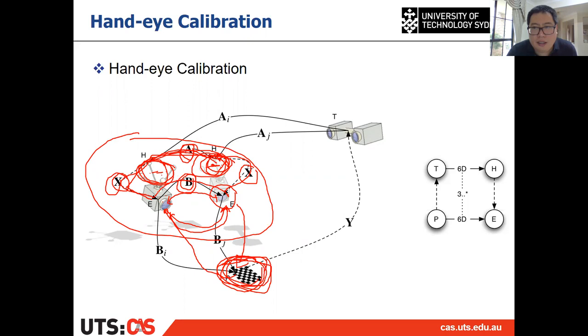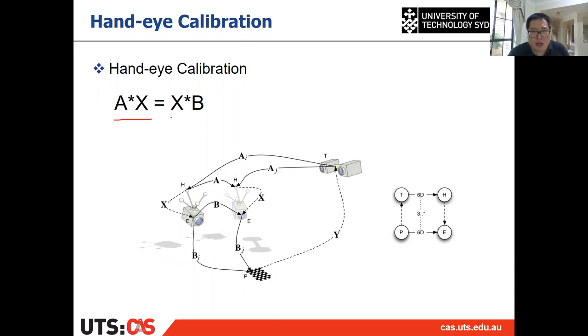So if we want to calculate the relative pose from this end effector to this camera, we can do it in two ways, right? One way is from here to here to here, which means it is A times X. And the other way is from here to here to here, which means X times B. Then in this case, we have the A times X equal to X times B problem,